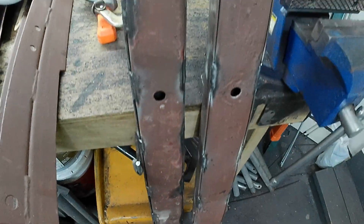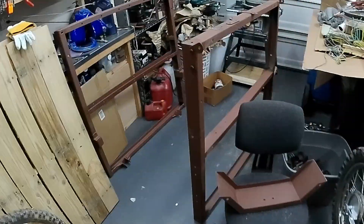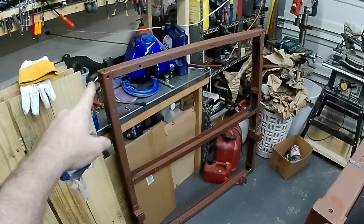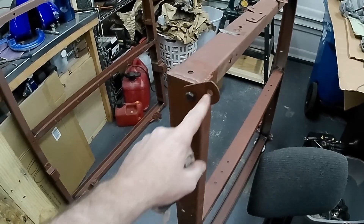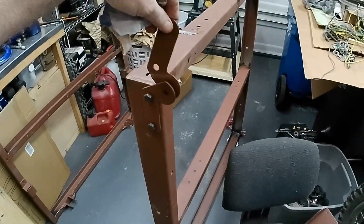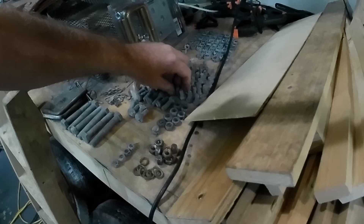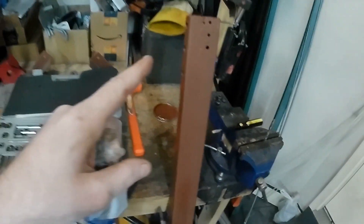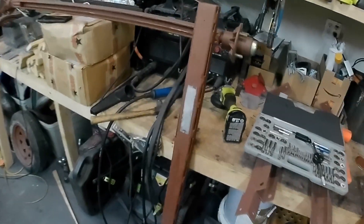Both of these are welded together. I only had one weld that popped - I ground that down and welded it back. It seems like this was a pretty decent heat. They're not the best welds ever, but some of them are pretty good. I'm sure that'll hold. Back working on the trailer - I've got the corners all painted up where I was welding, and now I am putting these hinge pieces on. Two short bolts go through and hold the two pieces together, and then the other two bolts go on the other piece. Now I'm having to clean up the bolts - instead of dealing with the sandblaster, I'm just grabbing several bolts and nuts. I also painted the trailer arms that go to the hitch, front and back, so they are ready to go.